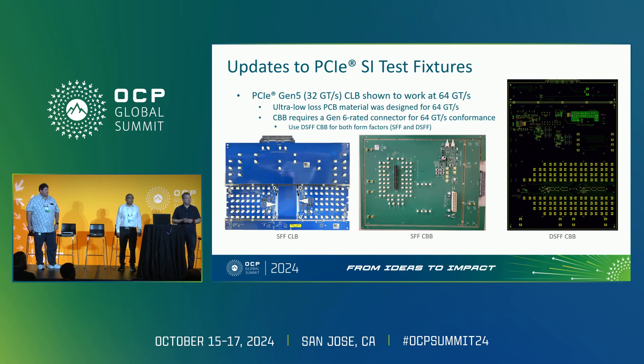That is the first picture on the left side. The one in the bottom middle — the green one — is the SFF CBB. The SFF is the current form factor today and had been designed up to Gen 5. We are going to eventually look at whether the connector itself — the TA-1002 connector — can meet Gen 6 requirements. If not, we may have to replace it so the board can be rated for Gen 6 NIC cards.